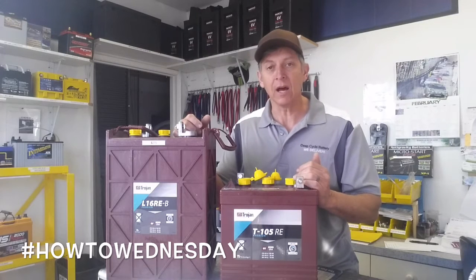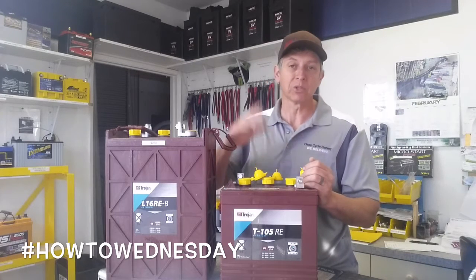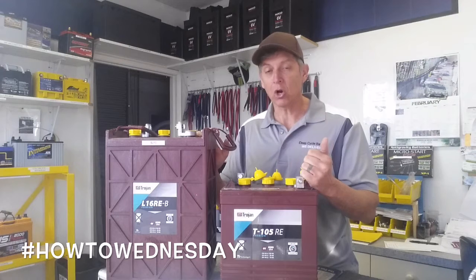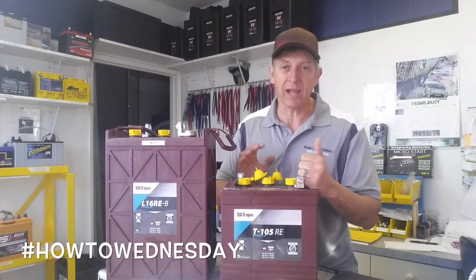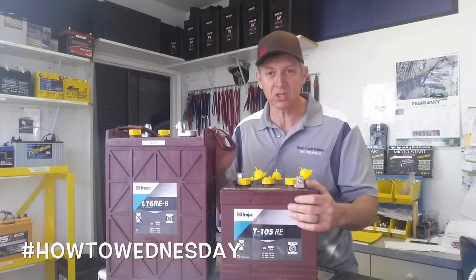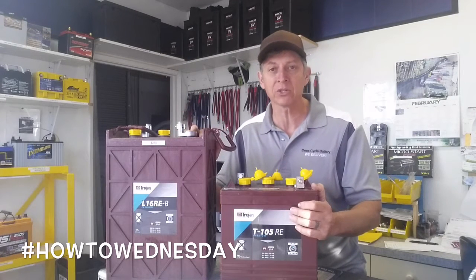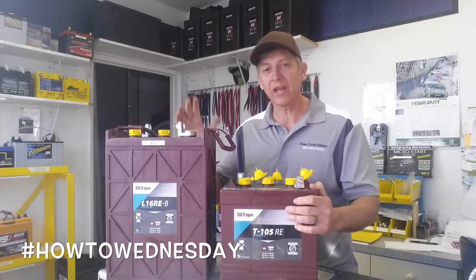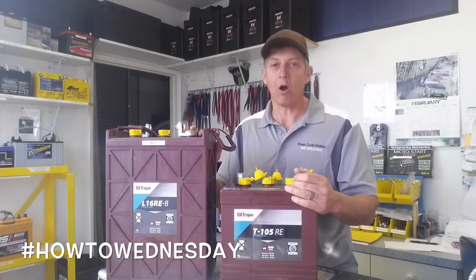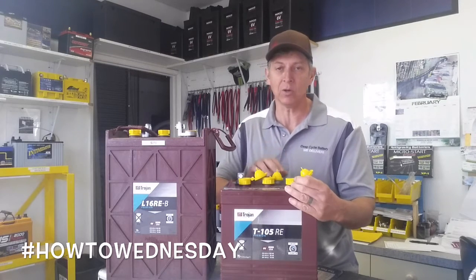The unbalancing that occurs from dropping a new battery into an old battery bank happens because the new batteries have less internal resistance and they're going to charge a lot quicker. The old batteries are not going to get fully charged, and the charging system may be triggered to stop charging. Once the new batteries come up, it shuts off. Let's say you have a solar system with Trojan T-105 REs or the L-16 RE — great batteries. The solar charge controller triggers 'done charging,' but your older batteries have never fully charged. Your new batteries are really working hard. It will actually cost you more money doing a patch by trying to drop a new battery into an older bank.